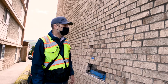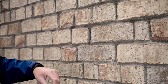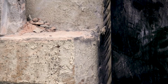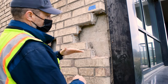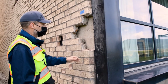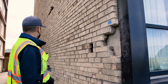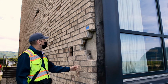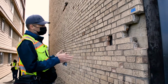Expansion joints, rather than having every mortar joint be rigid, allow movement. A flexible sealant like this, you can see how that allows movement. And so, vertically and horizontally, there should be room for things to move. And this is just a massive wall with nothing but grout and masonry. So there's nothing. When it moves, it tends to just break in little cracks in the mortar, or cracks all the way through the brick, rather than a defined place for it to move.